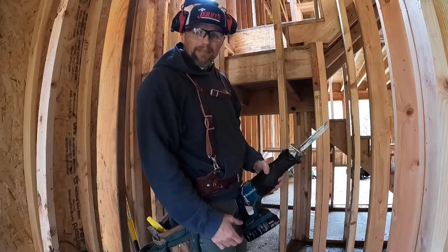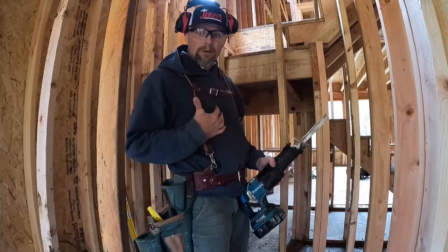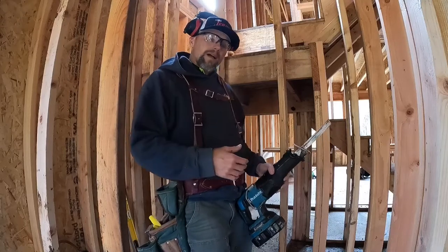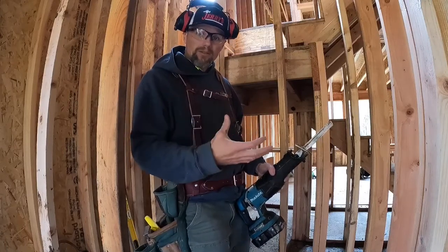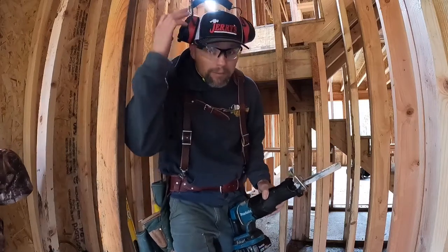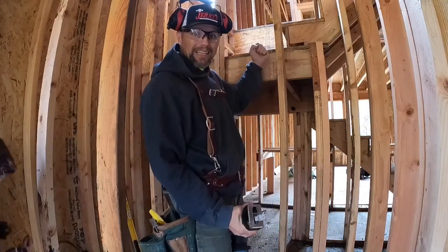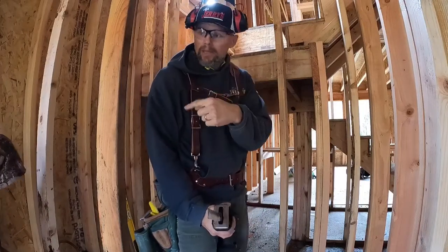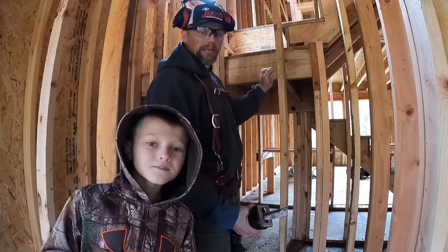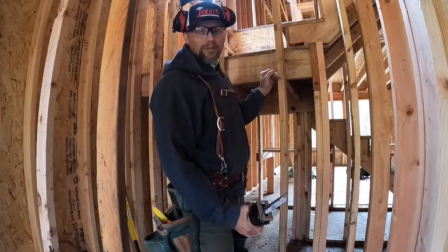Something that was brought to my attention by one of the comments on the page was to talk about safety. I'm the homeowner, but I've been doing this for a long time, over 23 years now. Doing commercial work is mainly what I do, but I also had businesses doing residential. No matter what you do, think of safety. So I got my earmuffs to protect my ears, and safety glasses to protect my eyes. When I go to cut this, it could be wedging down on it because there's weight. Even though my temporary shoring is helping push it up because I got it wedged tight, just be careful when you're sawing, cutting, for any sort of kickbacks. So pay attention to that sort of thing.